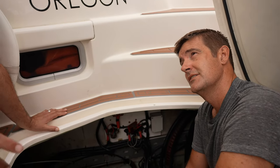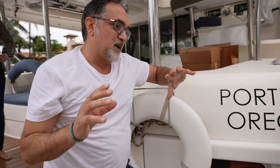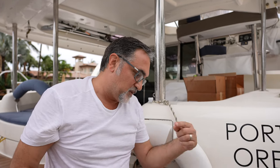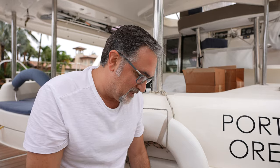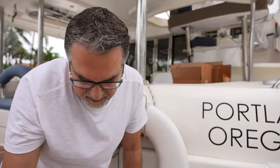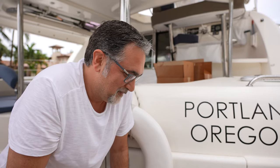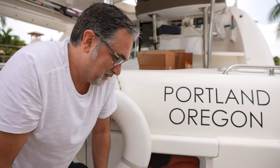Oh yeah. A good trick to make sure you have no leaks is to start with fresh water. So you have fresh water in your 5-gallon Porta Flush Junior, then you run it. If you see that the level stays stable, then you know that you don't have any leaks, and then you add your chemical afterwards. Because with a more complicated system, you could have some other hose that's going somewhere and you just don't know about it, and then you end up pumping your Barnacle Buster overboard, which is expensive. Exactly.